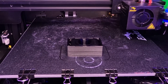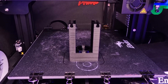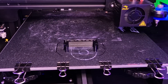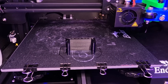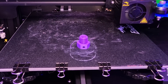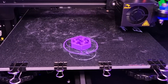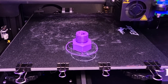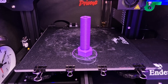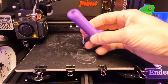The differential motion assembly has a lot of similar-looking parts. The base assembly is slightly longer to allow room for the second screw. The traveling nut has just one hole in it for a single pin to hold the second screw in position. It's the same end stop for both assemblies, plus a single pin. To make the differential motion work, a slightly smaller screw is added with a finer thread pitch — and the main 3/4-10 screw now has a 1/2-13 female thread in the end for the second screw.